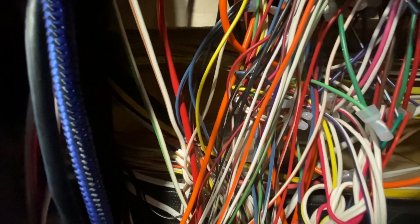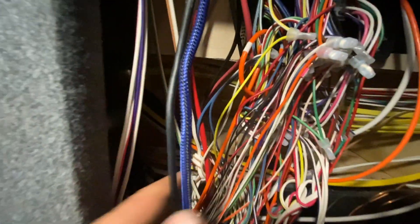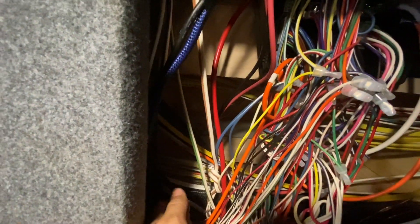Right here you can see the vent pipe that was up on the roof that we talked about earlier — you can get access to it right there. We actually didn't know that at first so we accessed it a little bit lower down, but it works just fine there too. What you can also see is the HDMI/USB extension we used for the Touch 50 — it comes down a chase in the wall that runs right down into this cabinet, super easy to access. We ran those up across the top along with the solar PV cables, PV out into the charger, down the raceway.